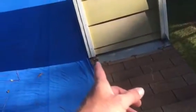So it's no coincidence that all of these stains that you're having, the front door just under us right here, are, you have the soffitted area, and then basically the length of that soffitted area to this chimney are about the same. So on the interior wall, somewhere right around in here, okay, and the flashing, you can see that this flashing is rusted, and I'm pretty confident that's what's going on, because there's simply nowhere else it can be coming from, the water. Your chimney cap is tight.